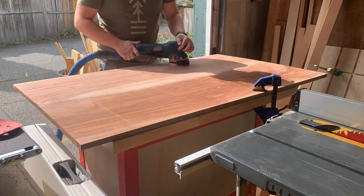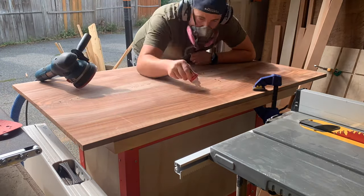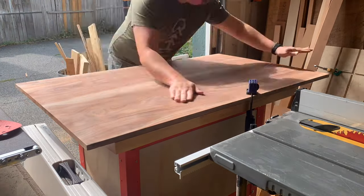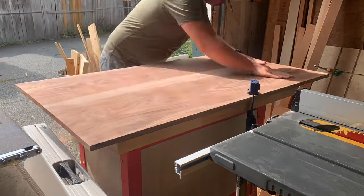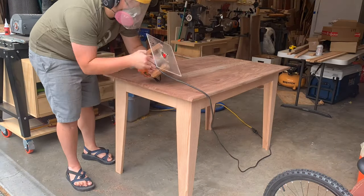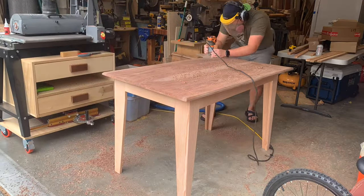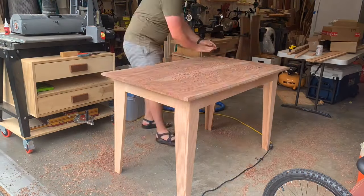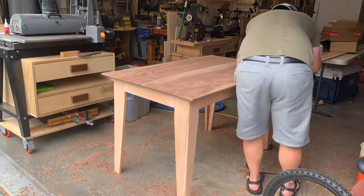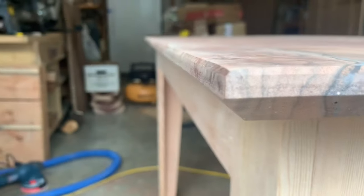Flattening - if you're doing a lot of different boards you might have more joints. I just had the one - you can just use a sander or belt sander, or I used the drum sander. You're just going to flatten it out - it's just going to be a lot of sanding. Got some more void fills that I did with the CA glue, but just get it nice and flat. Once it's flat, add an edge profile. I'm going for this modern look, so I wanted a 45-degree bevel - the chamfer. Just got this trim router with a chamfer bit - a heavy chamfer on the bottom and then a light chamfer on the top. Just work your way around. A light, hardly noticeable chamfer on the top and it really just adds a lot to the look. It's gorgeous - this Claro is amazing, just a nice little modern vibe.